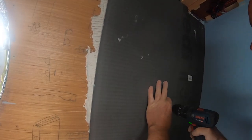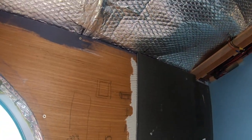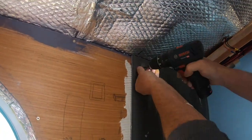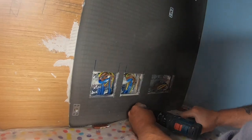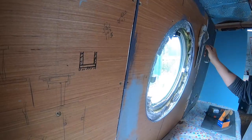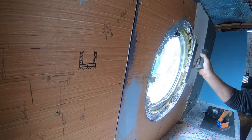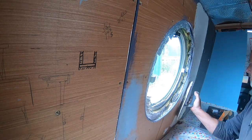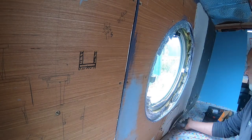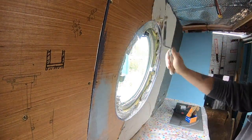If you've watched our previous vlogs, you'd have seen this same board being used when we fitted out the shower. It's a company called Wedi, and it's like a foam board. It's cement resin with fiberglass mesh inside it, and it's designed for waterproofing as a backer board for tiling. So yeah, it's a tried and tested thing, and we're really pleased with the outcome in the shower, so we've carried on in the kitchen.